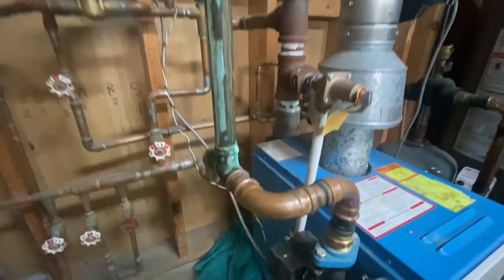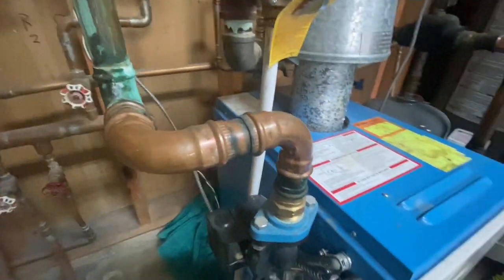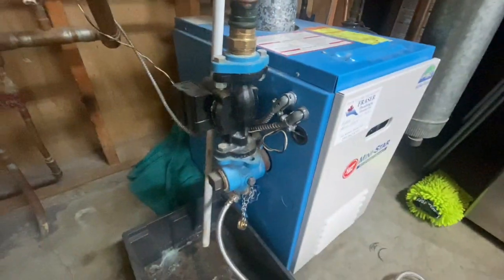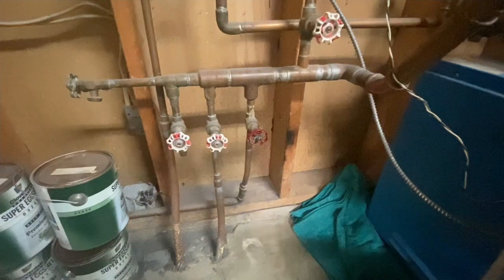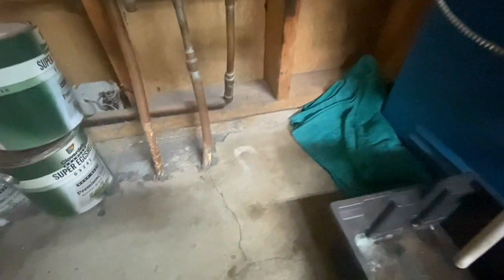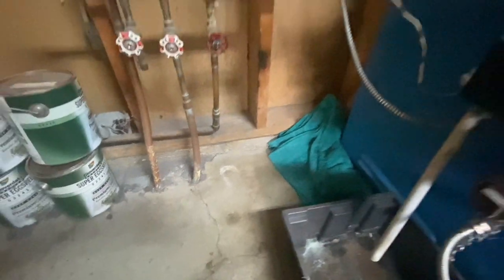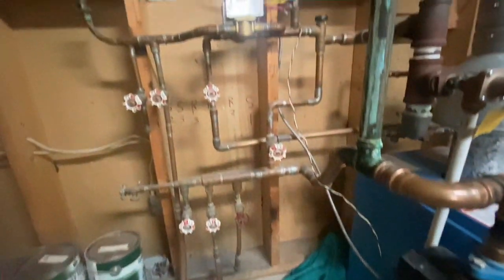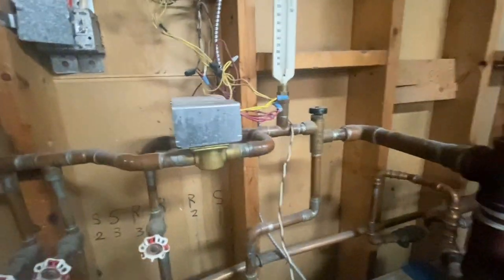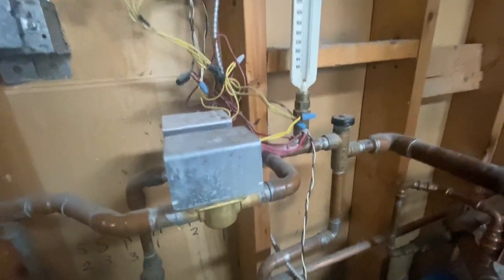You can see a lovely mixture of glycol, old press fittings that have been weeping through here for a while, and we've got loops that go underground. It's still high temp to baseboards, but unfortunately it's a big no-no to go underneath the concrete - there's not much we can do about that now. These are the two zones for the basement; wires are a mess.